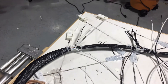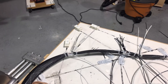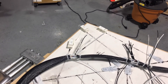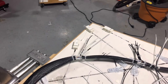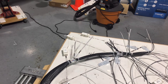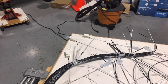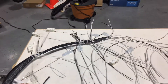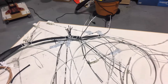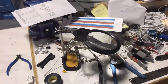I've got all the CAN bus parts laid out right now. I'm going to do the soldering and then put the heat shrink over them with labels. Then I'll get the rest of the ends prepped, because I'm going to have to splice a piece in since that end goes into one pin — you only want one wire going into a pin when you crimp it. Just about to get the CAN bus part finished, and then I'll be doing the RS-232 serial ports. Wish me luck on the soldering job.